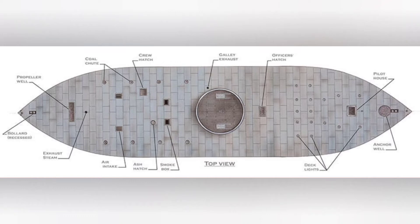As initially called for, Monitor's deck was only supposed to be 18 inches of wood, as Ericsson regarded this as sufficient to stop projectiles from penetrating the deck, but eventually 1 inch of iron was added on top. Due to the majority of Monitor's hull plates not being curved to save on time, the connection between the lower hull and upper hull was accomplished by a frame and bolting. The system was good enough at holding the ship together, but it could not withstand extensive weather conditions nor maneuvers such as ramming.